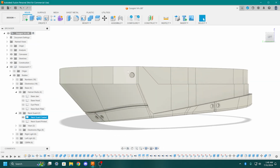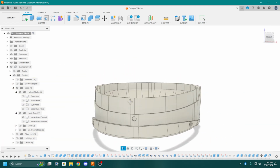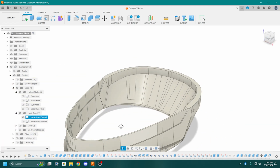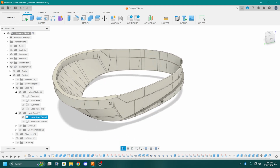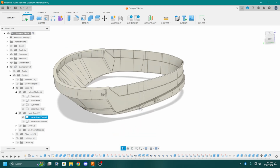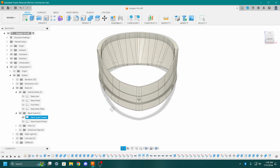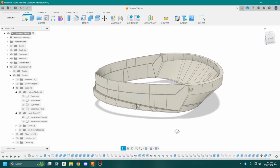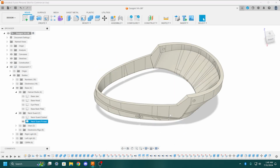You'll notice the holes are only partially indented. We're going to punch those out later, and then this ridge here that's going to be cut out later goes all the way up to the surface, and that's going to be for when we actually do the silicone pour. We're going to be molding and casting this out of polyurethane, PT Flex. I think we're going to do PT Flex 85. I haven't decided the official mixture yet. We'll figure that out when we get there. So yeah, you have the casted version or the printed version, it's up to you.